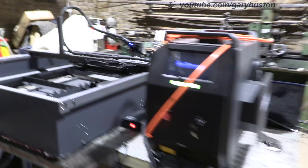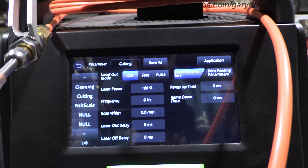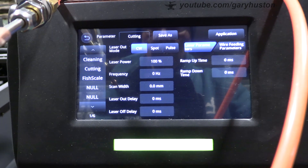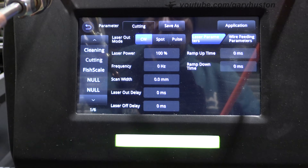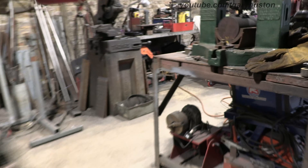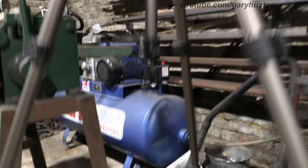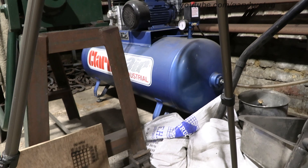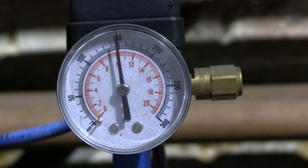Wire brush over that and it'd be perfect. So let's try some cutting - this is what you've all been waiting for. We've got it set on cutting; everything else is at zero except the power at 100. We've mounted the gun on the gantry and changed from nitrogen or argon over to compressed air from the compressor. We're running at quite high PSI - 150 PSI.